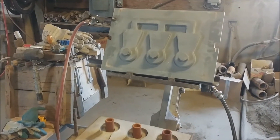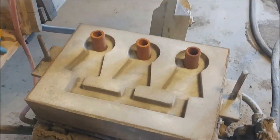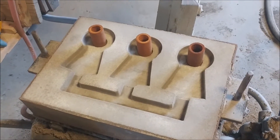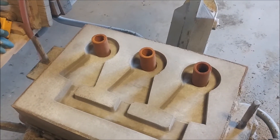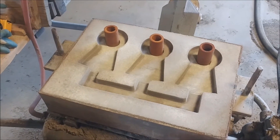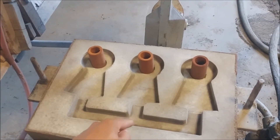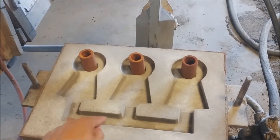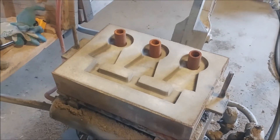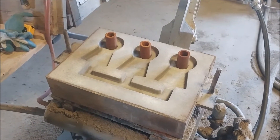Here's a look at our pattern for our hammers. We've got three on a board there and we've just pulled the pattern out of the drag here. You can see we use sand cores to keep the metal out of the hole where the shaft goes, or the pins. We pour metal down here in the sprue and it feeds through these gates right into the hammer pattern and fills the box up with the white iron we use for our hammers.